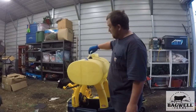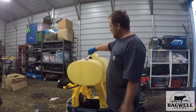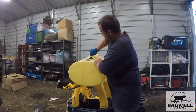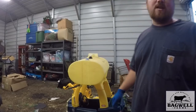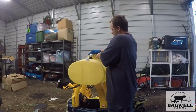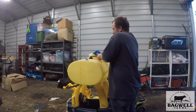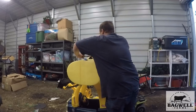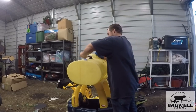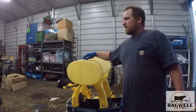I got it tight. I'm going to put this port in — those ports are really easy to put in. You just take a hole saw, drill a hole out, and tap it up. On bigger tanks it's a little more aggravating depending on where you put it, but they're nothing to be afraid of if you haven't done one. They've just got two rubber washers on each side of the nut where it tightens down — you just tighten it with a big set of channel locks. There you go. I've got my port, I've got my tank. Now I've got to run hoses.